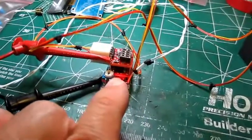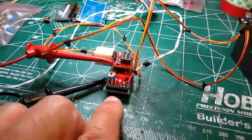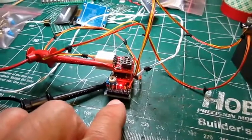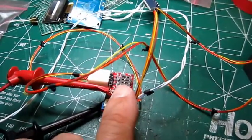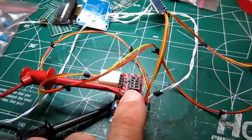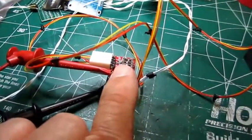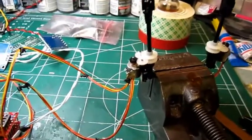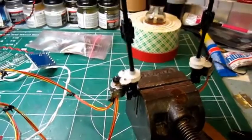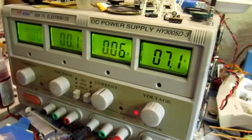I've got two step sticks that I'm using right here on top of an Arduino that supplies the logic, and I've got a four-position DIP that allows me to do directional control and also my stepping format, whether it be full-step, half-step, quarter, micro, whatever. I believe I'm doing a full-step here because these are very low-res motors — I think they're 18-degree steppers — and I run them at about 7 volts. You can see they're only drawing 60 mils.